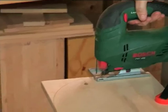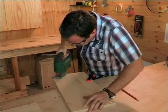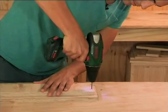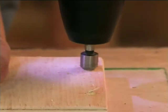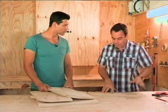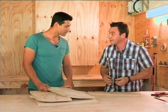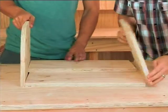Remember to protect your eyes with industrial goggles, because cutting the wood with a jigsaw can be dangerous. Try and stay as close to the line as possible as you cut. Now we're gonna mark up all our timber and drill our holes exactly according to the plan. At the beginning of my plan I see which bit goes where, and I actually mark up each panel — put a bit of masking tape on there. It stops confusion and helps you do it quicker, neater, and easier.